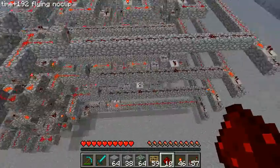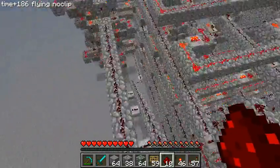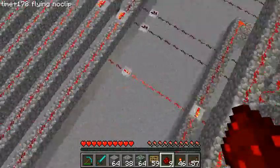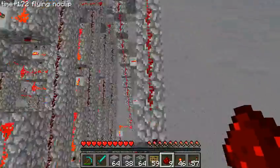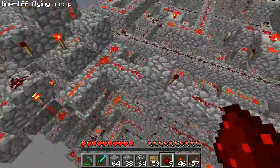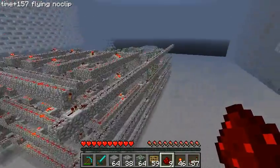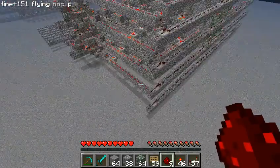You can see that 1110 passes through onto this return bus, and we get 1110. The purpose of this line to detect whether it's adding or not is that if it's not adding, this line goes red, making all these red. Like I've done before, where I've got a signal, I invert it, then invert it again — so this stretch is inverted, I force it high, which forces the signal low, meaning nothing is actually put onto the return bus. So when we're not doing addition, we're not returning anything from the adder.